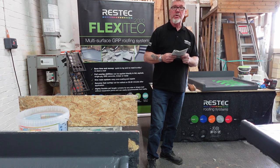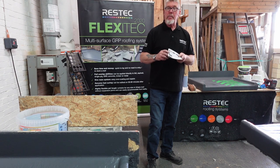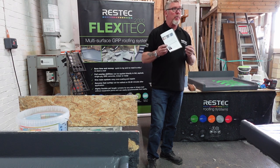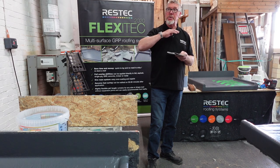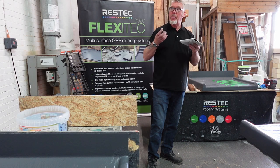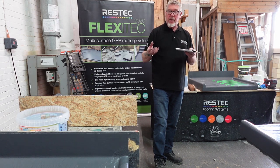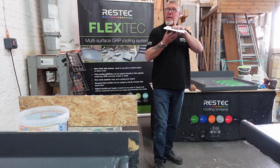So you've got the picture at the top there with a bloke throwing some catalyst into a bucket and mixing it together. Primer: make sure when you put your primer on, you don't miss anything at all. If you get black patches on the roof, it's because you have skimped with the primer. The bitumen will migrate, it's called polymer migration, from an inert object like your fiberglass, which will have gone off, but it still migrates in there.